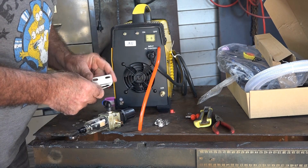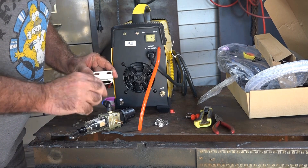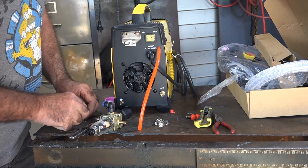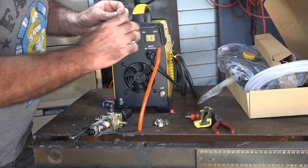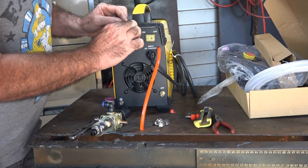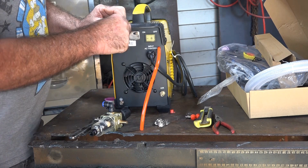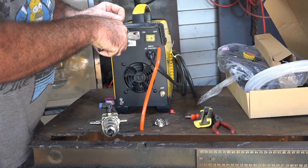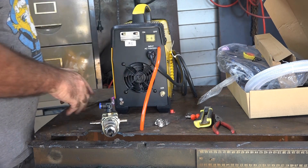Now what you need to do guys is get this bracket thing here - it's got a little sort of raised piece, make sure that's down because that stops this from spinning around when you tighten it up. I've got the raised piece underneath, make sure it goes downwards. They supply a couple of little washers - put them on as well, that gives us the sliding ability to slide from one side to the other. Tighten them up guys, don't go too crazy, just make sure it's not going to fall off. I normally do it finger tight and then just give it about half a turn with an open-ender until you feel it starting to snug up.